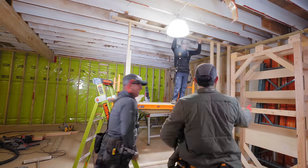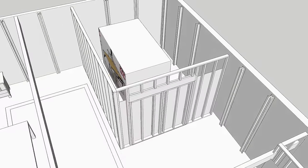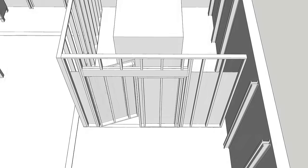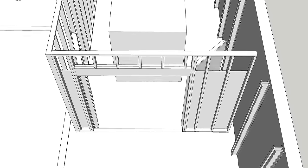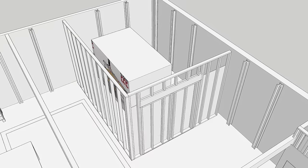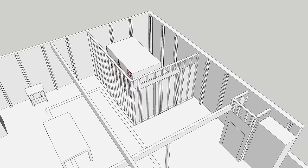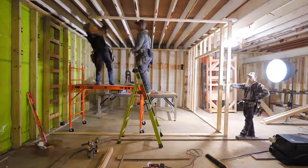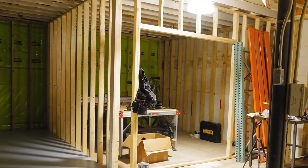For the door opening I went with roughly seven feet wide and just under eight feet tall, which should allow me to easily get full sheets of plywood loaded onto the CNC. The doors will open inward and swing completely out of the way against the wall, and I'll be building them with soundproofing insulation to help keep the CNC noise isolated. The CNC room dimensions are 12 feet wide by 15 feet deep. Once the front wall was framed, we repeated the process to frame the side wall — all framing material pulled from my old shop — and with that the CNC room was framed.